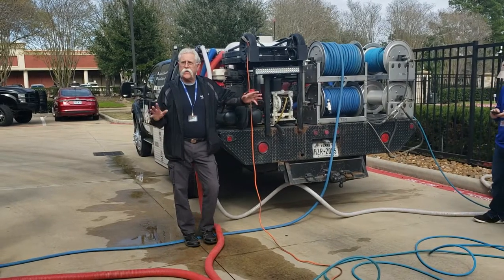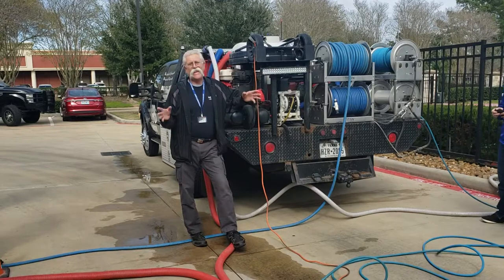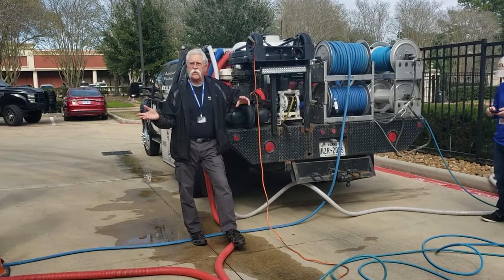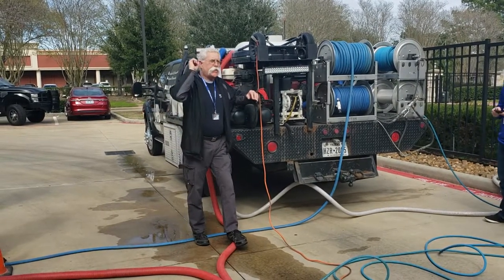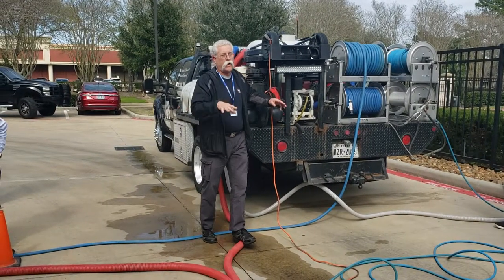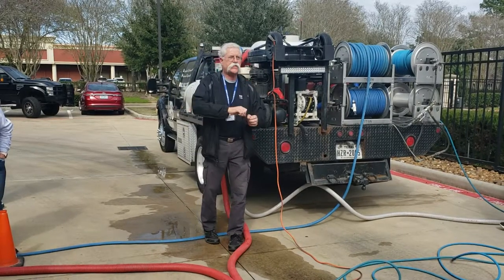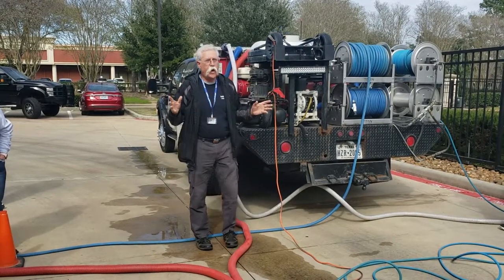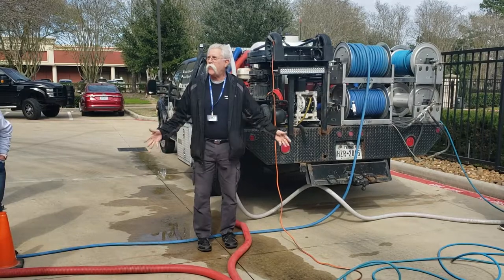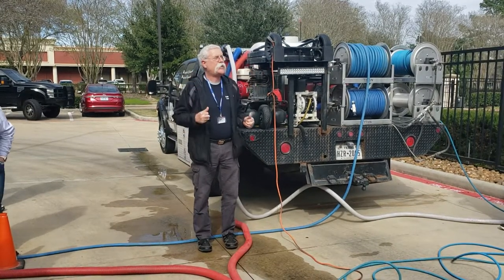There is a magic trick using heat with the vacuuming surface cleaner. When you're spraying water out at 215 to 220 degrees or more, as soon as it hits the surface it wants to become steam. Steam is easier to suck up than water. So if you've got your heater turned up, you can reclaim the water easier.